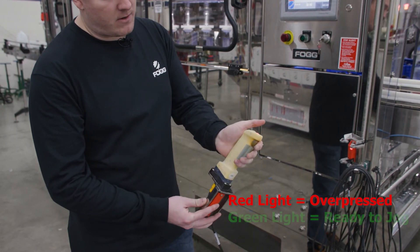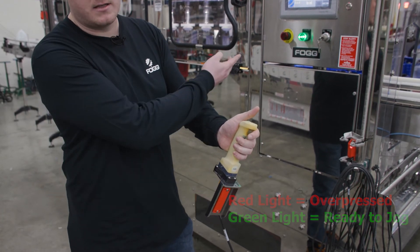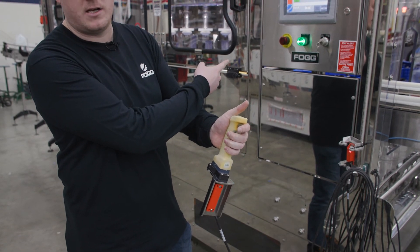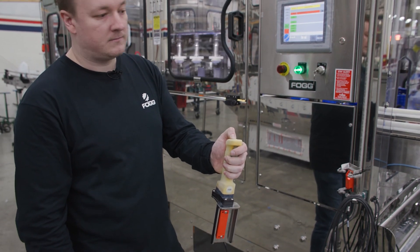So you need to go just the right amount until your light turns green, and then you can press once and you can see that your MCR will reset and your system start is green and you're ready to run. Then to jog the machine, you can hold in the button and off you go.